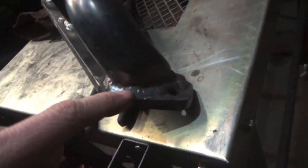So after a grueling time trying to TIG weld these headers, I don't know if I had the wrong filler material or if I didn't surface prep them enough, but it just kept cottage cheesing. It kept getting air bubbles in the weld, so I ended up getting really mad and MIG welding the whole thing. So it's half TIG, half MIG, but it turned out actually nice, I'm not gonna lie. I actually had a thought to MIG weld it first, but I was like, I got this fancy TIG welder, I might as well use it, but stuff happens.